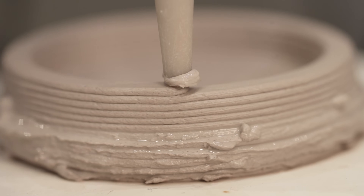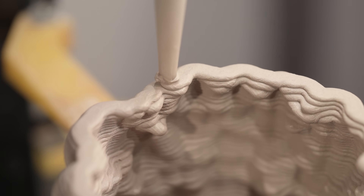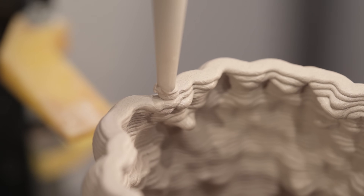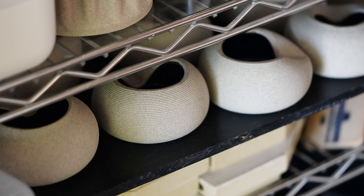When I first saw these things online, I thought this was a cool way to scale up production, make ceramics more consistent, do it at scale, make the whole thing easier. I learned eventually that is not really true at all. 3D printing clay is kind of like 3D printing with toothpaste — it's very soft, it's gooey, gravity can do weird things with it, you can get bubbles in it, and there's a lot to go wrong that doesn't happen with plastic in the same way.